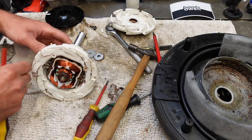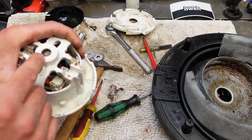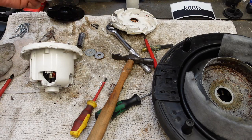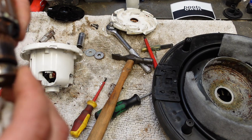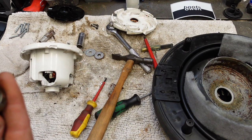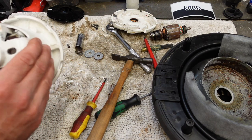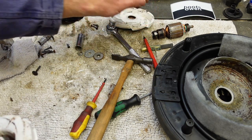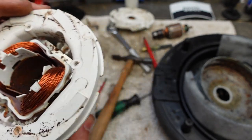So the rotor may or may not fall out now if I ask it to. The bearing could be stuck on the other end - the bearing could be rusted in there. There it is - came out bearing and all. So that commutator bar does not look perfect, but we're not going for perfection here. Those bearings are a bit wild. They're a bit grim. I think those are like skateboard bearings - I could put new ones on it. Not until I get it going. So this armature then should fall out.